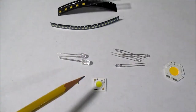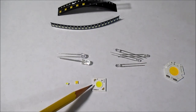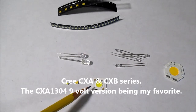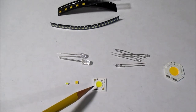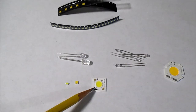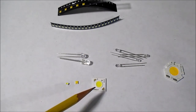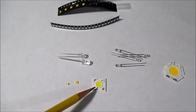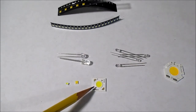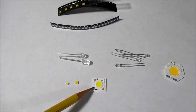The next LED, and perhaps my personal favorite, is the chip-on-board style — this is the Cree CXA 1304. It is a 4 watt LED, COB meaning chip-on-board. The CXA and CXB series come in various power ratings and sizes, all the way up to 150 watts, which is a lot of lumens. The reason I like these little CXA 1304s is because they are very inexpensive, can make a lot of light, and they come in a 9 volt version — most companies do not make such a low voltage version of these.